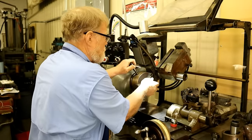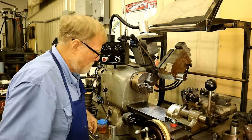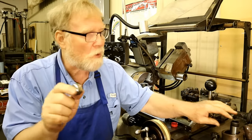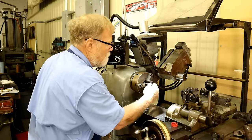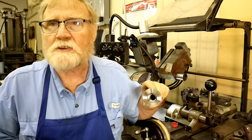Biggest thing we've got to change is this chuck. To put this ball on this machine the way I want, to get it the most perfect alignment, this would work, but it could be off a little bit. I can't do it. A collet's much better.